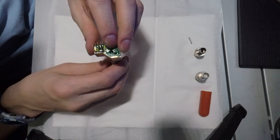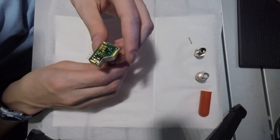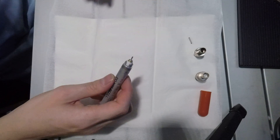The back cover of the preamplifier box can be removed by desoldering three solder balls. Then desolder the flying lead, which will come out of this hole and attach to this pin. After that flying lead is desoldered, the tube may be unscrewed from the preamplifier box.